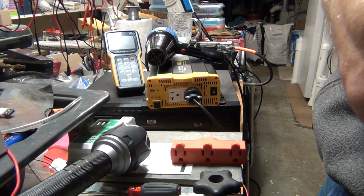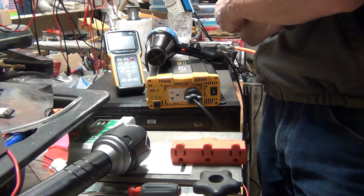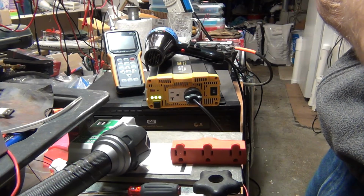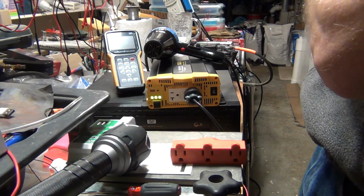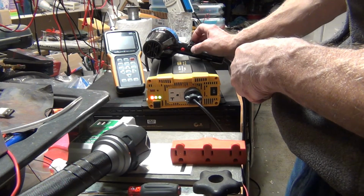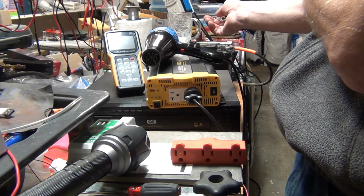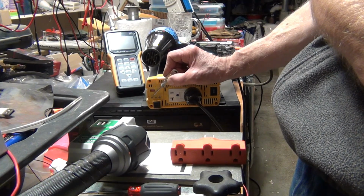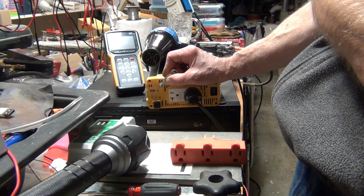That's kind of disappointing, to be honest with you, because 800 watts is almost the maximum load. So I don't know what it's going to take to turn it on. I mean, you can try 900. Okay. And as you can see, 900 watts will draw a lot of power from the battery, because I have only one battery connected to it, and the battery voltage will drop so much that this will become orange. But it's not in a critical position. It's just a little bit lower battery voltage.